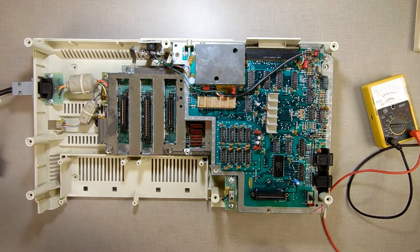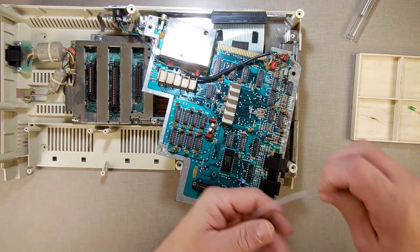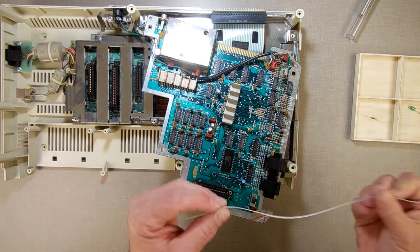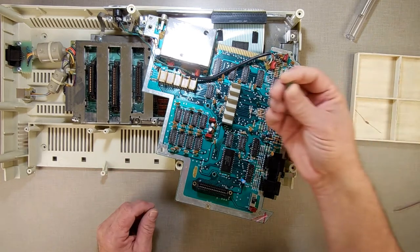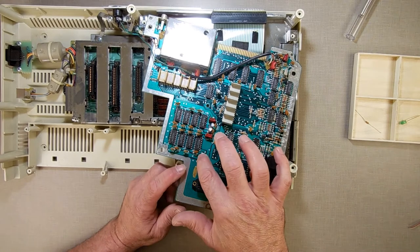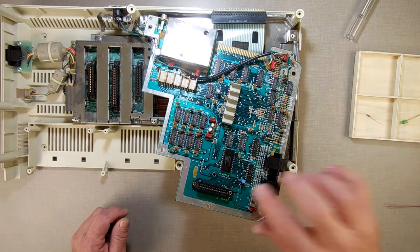All right, now to round up some parts. Okay, I'm back with all my parts I need. Piece of wire. One's red, one's gray. Red will be my power, gray will be my ground. A 330 ohm resistor. And the green LED. Now once my soldering iron is warmed up, I'll attach my wire and my LED. Well, I'm going to attach my resistor, then my wire.